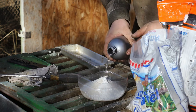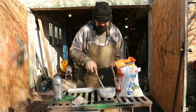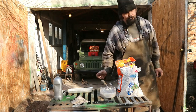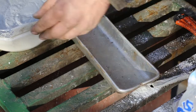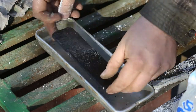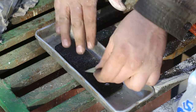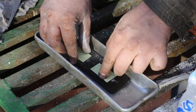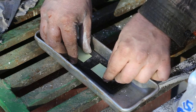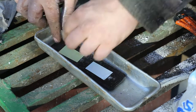Now we're starting to make the mold. What I'm doing is mixing a 50/50 ratio of plaster of Paris and fine aquarium sand, and I'm adding water, trying to make the mixture as thick as honey. Next I'm going to use a metal tray and attach my 3D printed model to the bottom of it. The idea is to have the plastic model on the bottom of the mold and all the plaster of Paris hardening above it.